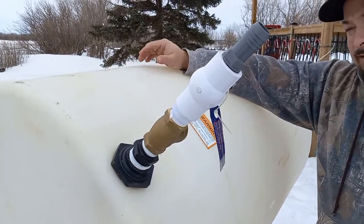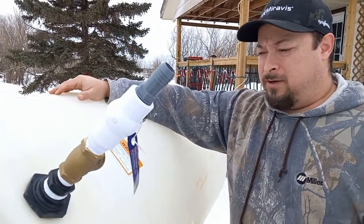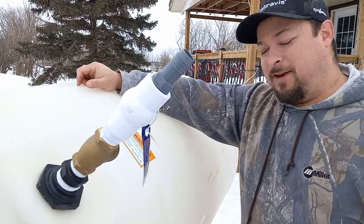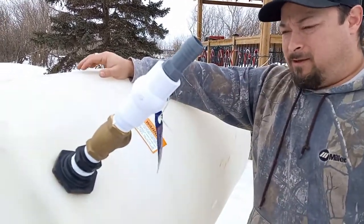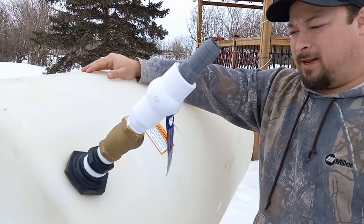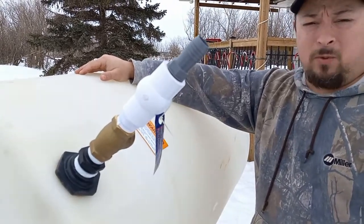Really, all there is to it, you're going to have your hose on this end, go into the hose to the jet pump in the basement, and that's all you should really need. It's just going to be a matter of whether these will actually stay and not leak because of all the dissimilar fittings that we're using on this. Like I said, it took me 5 minutes to throw this together. If for whatever reason there's leaking because of that, I can replace this stuff in no time and get it working again. If it's a minor leak, we have a drain right beside this. It's not the end of the world. It'll at least allow us running water here.